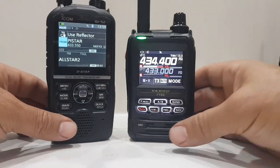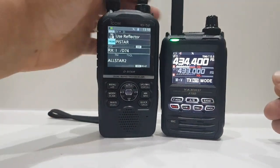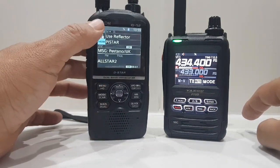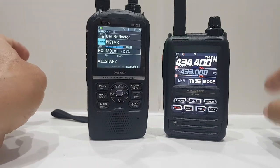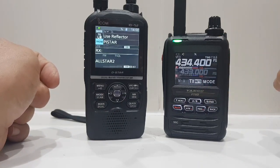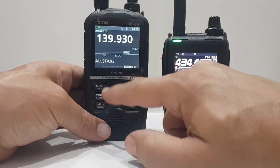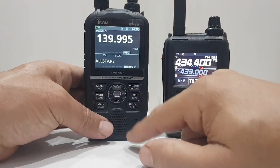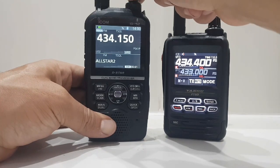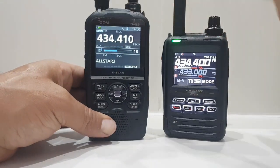The main thing is I'm just showing these two radios side by side. You can see that the ICOM ID52 is a much bigger radio. You can hear that's the ID52. Just remember that the ID52 will receive D-Star simultaneously on the A and the B band. The FT5 will also receive simultaneously on the A and B band, but you won't hear them both - it mutes one half when one is transmitting. Let's just listen to AllStar on the ID52 - let's get the correct frequency in there, which is 434.400.